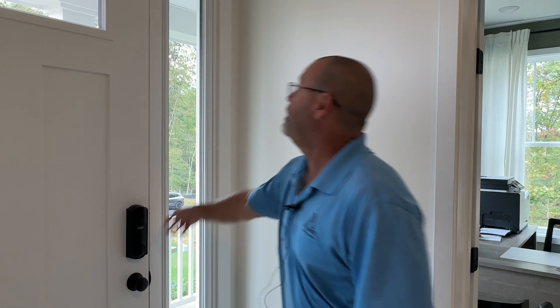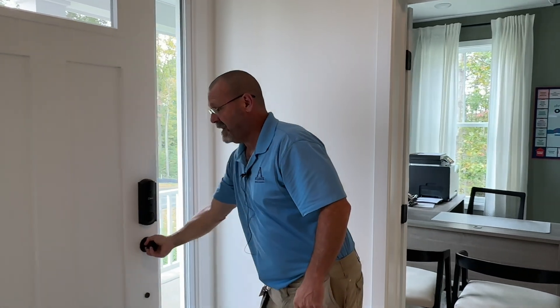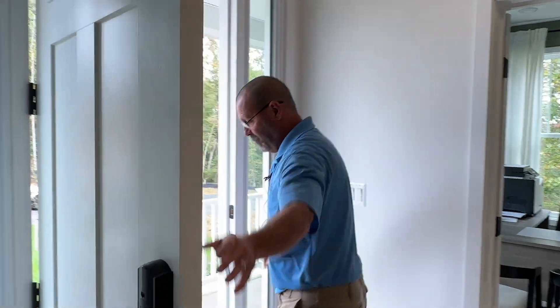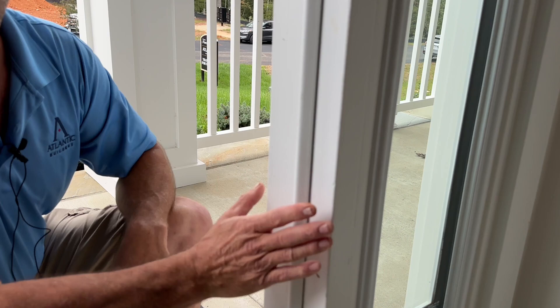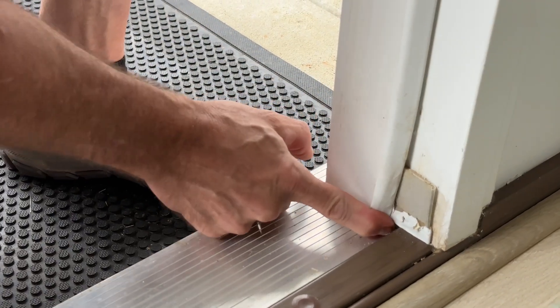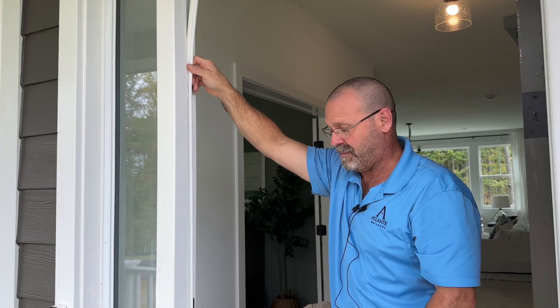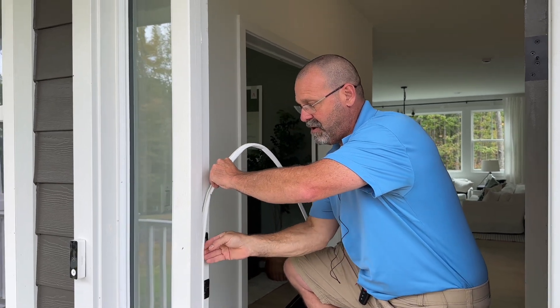Now we're in the foyer and we're going to check doors. You should check all exterior doors — sliders, front door, back doors, and the garage door. With this door, we want to make sure there's no air gap around it. We're going to open it to make sure we've got good contact where the deadbolt works. We're also going to look at the weatherstripping around the door. If you can squish it and get a little water coming out, it's time to change it. If you've got any rips or tears from cats, dogs, or anything, they should be replaced. You can go to Home Depot or Lowe's and get new weatherstripping — it just slides right back in very easily.